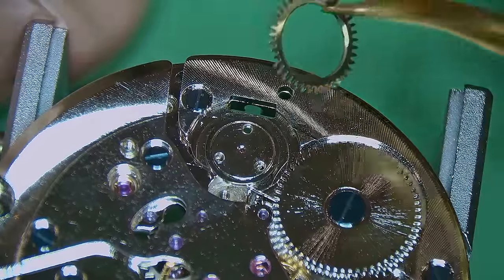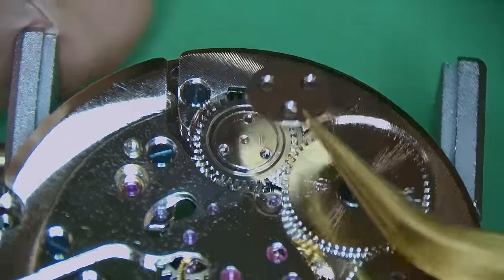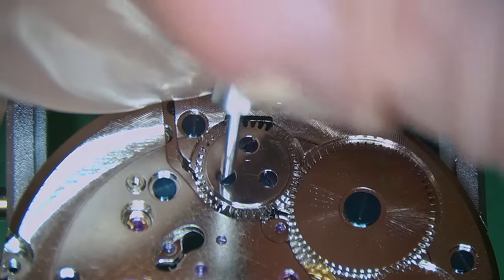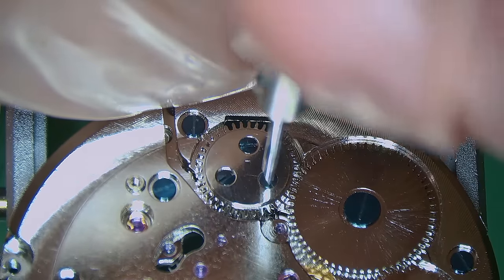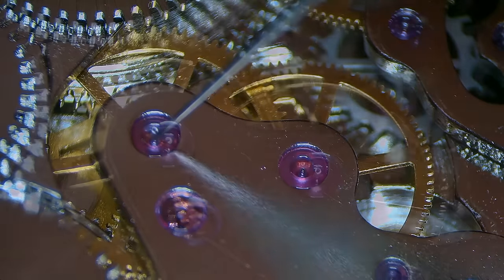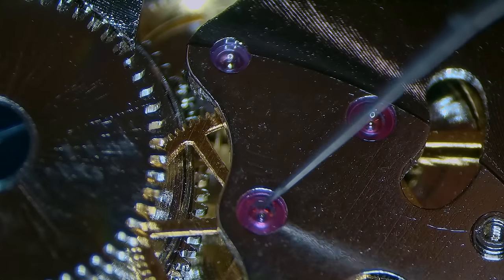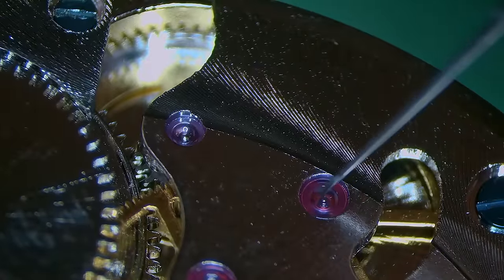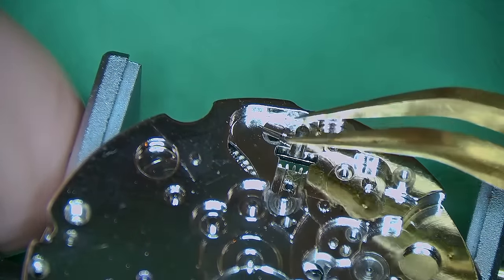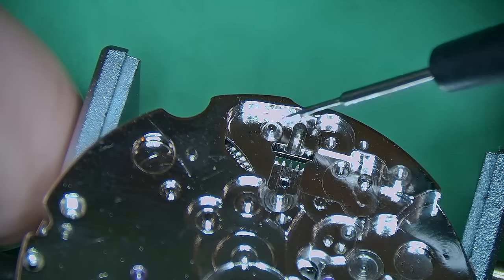A little 9415 onto the side for where the crown wheel is going to go, lining it up into place, then putting the core of the crown wheel on top — held in with three small screws which are not reverse-threaded. You only have a reverse-threaded screw if it's bang in the middle, to basically stop it from unwinding itself. Now for the oiling: I use a combination of 9415 on the center wheel and 9010 on the rest. Sometimes I used a little too much oil so I removed it with Rodico, then continued with the oiling and repeated the entire process on the dial side.